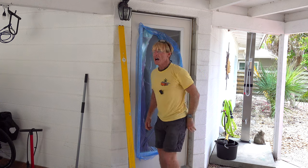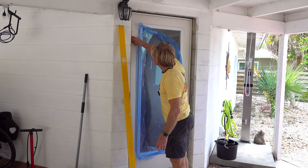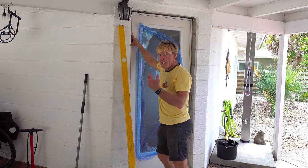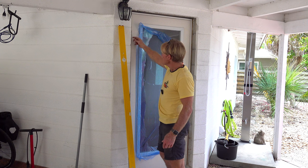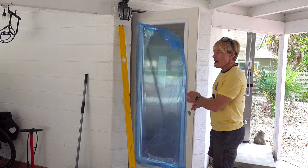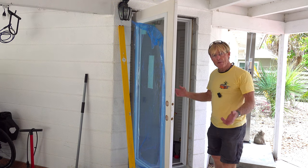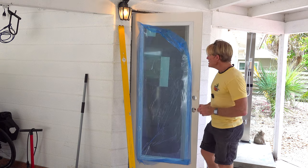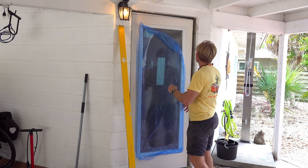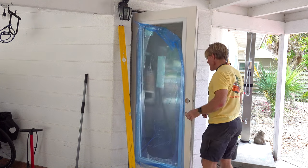What's different about this block is I wouldn't have trouble with this at all if it were wood, because I could just put in a finish nail. I may be able to do that into this and see if it'll hold. But with block, this is going to be held in place with tap cons. There are strips here that are weather stripping and I'm going to pop those out. I want to leave them in for a little bit just because they help me in fitting, because once I pull them out there's a big gap on the inside. I just want to make sure I'm fitting good.